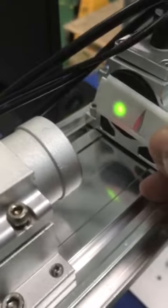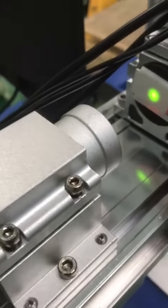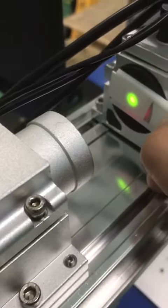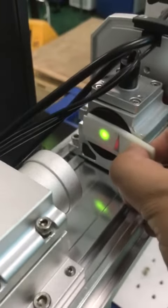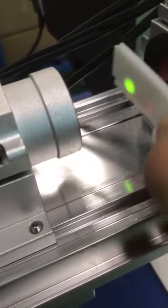When you test the fiber laser source, make sure the laser source is well connected to the 24V DC power supply, and that the 25-pin signal cable is fully connected between the control board and the fiber laser source. This laser source is working perfectly — you can place the beam checker at the head of the fiber laser source directly, as shown here.